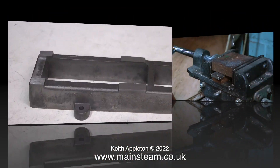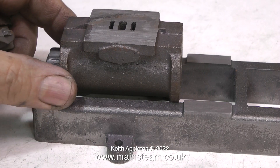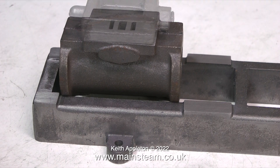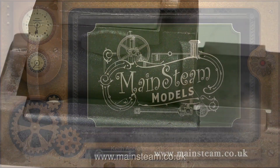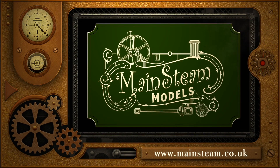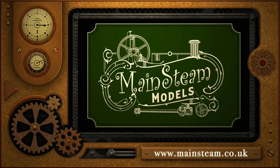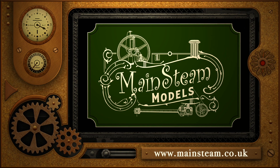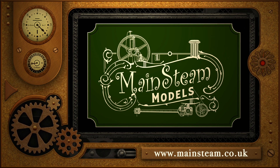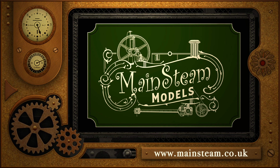And now it's back to the drilling machine to drill the holes in the lugs the correct size — a 3/16ths of an inch diameter twist drill. Why 3/16ths of an inch? That's clearance size for 2BA, because I'm going to use some 2BA studs to hold this bed down onto the finished plinth. So to recap, I've managed to make this part by just using a file, a belt sander, and a drilling machine. And that's it for this episode — thanks for watching, and I hope you've found it useful. Please visit my Mainsteam Models website and click on Video Playlists to find other videos and watch them back to back.